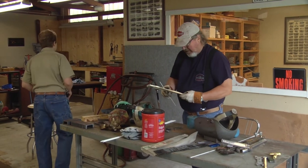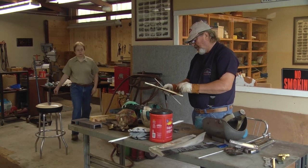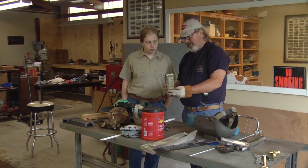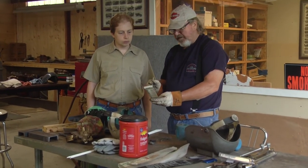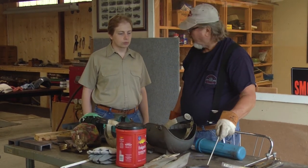There are a lot of different and nice helmets. I do not recommend the ones with batteries in it — so when you start to weld it goes dark. The batteries are always going dead. You'll get used to a flip-up helmet — you'll learn to put it up and flip it down. Here's a one-sixteenth, 60-13 electrode — see right here, the amperage is way down. This would be welded for almost paper-thin stuff. An eighth-inch electrode would work fine for what you've got.